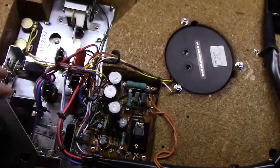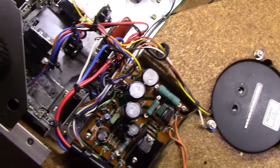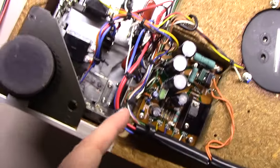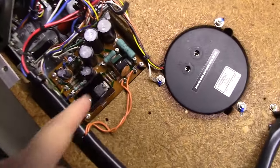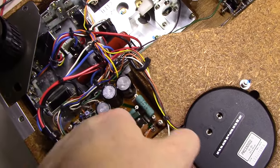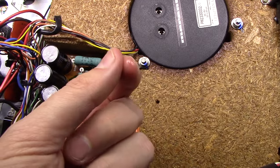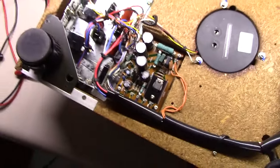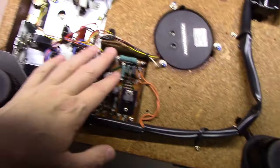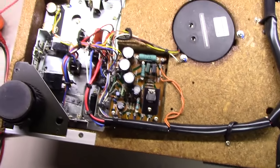Good news — I took a voltmeter and checked the little tag strip down in here that feeds both power from the wall and into the transformer, and I was getting voltage on both sides. But then I noticed something interesting down in the capacitor area: one capacitor has a little bit of wet residue — it's leaking. This middle capacitor right here has started leaking, and that's likely what's causing the issue. So we're just going to go ahead and recap this, clean all the switches, and I'd bet anything this thing takes off and starts working.